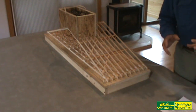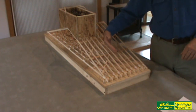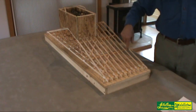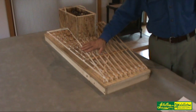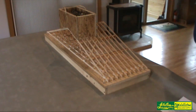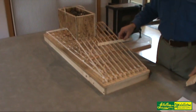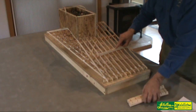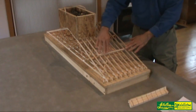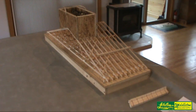Going back to the literature I was talking about, it shows that once you have a solid base of trusses you can then go 10 trusses further — or 20 feet at two foot on center — and only use lateral bracing until you need another group of trusses braced with both lateral and diagonal bracing. To test that theory I made some blocks of wood with slots in them to fit over these trusses and attach continuous lateral braces all the way across.